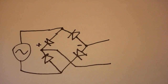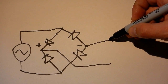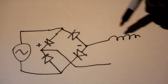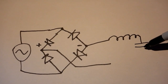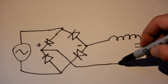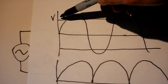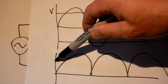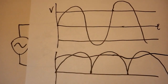In order to get from that rectified wave to your ideal DC current, you need to add an inductor on the positive side and a smoothing capacitor. What you'll end up with is something a little bit closer to ideal DC current — actually what you'll probably end up with is something with a little bit of ripple, but it's close enough.